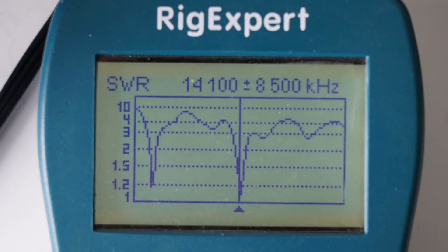The antenna was on a spider pole. What I'll show you on the screen is a shot of the antenna analyser showing the two very distinct resonances, and that's the sort of thing you're looking for — two distinct resonances. I've got up on the screen now the shot of the antenna analyser, and you can see it's very much resonant on 40 metres and 20 metres, which was the aim of the exercise. As I said earlier on, it's all very well modelling antennas, but in my book you build them just to make sure that they do actually work.